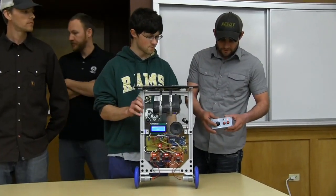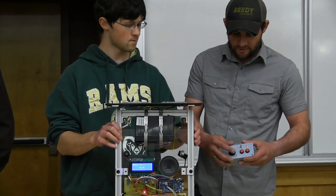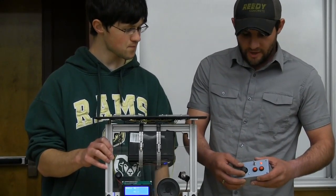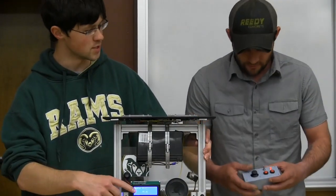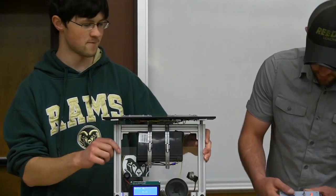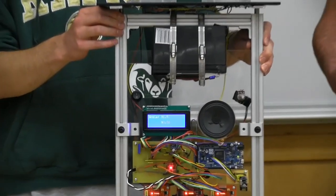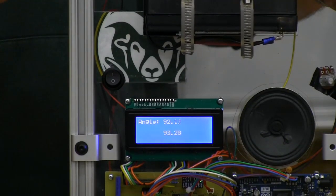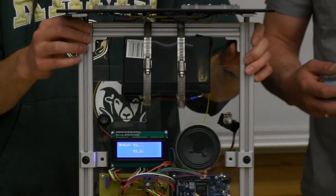We have the controller — this is a two-axis joystick that runs off two potentiometers. The forward and backward axis changes the set point; if you watch this number while moving the joystick it will change forward and back depending on which way you want to drive it. The turning also superimposes over the signal sent out from the PID.